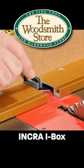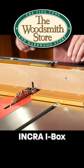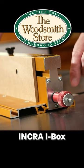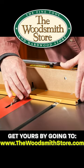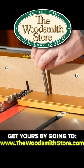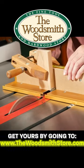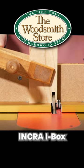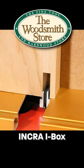The heart of this jig is right here. That's an adjustable key. So the first part of the process is going to be to turn the red knob so that the two parts of the key come together. So now I'll move the stock ledges into place and tighten them down. The next step is to raise the blade to correct height. And now we'll adjust the width of that key to match that slot.